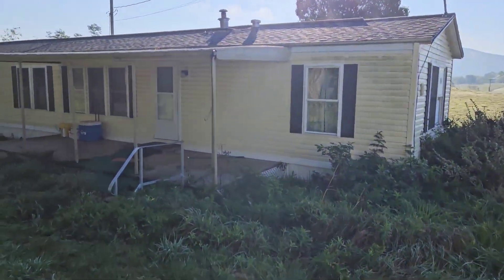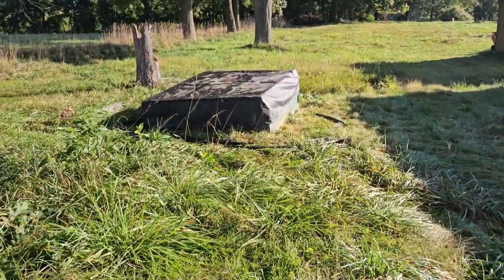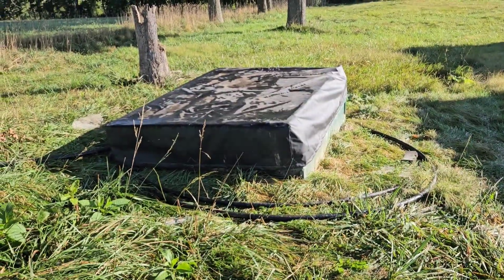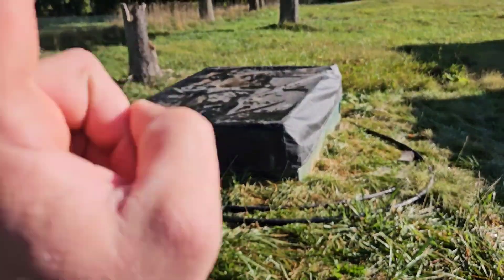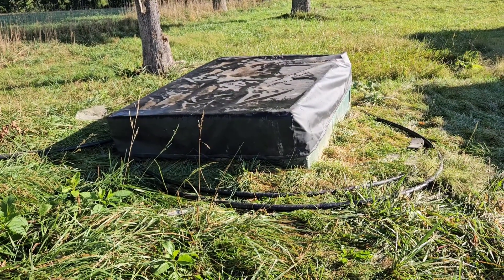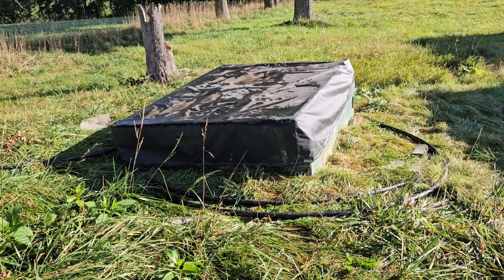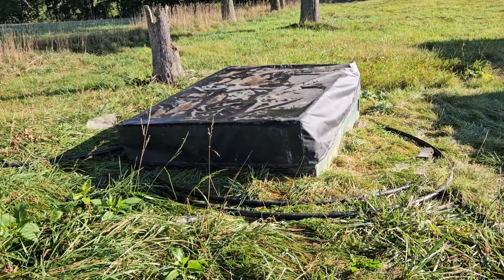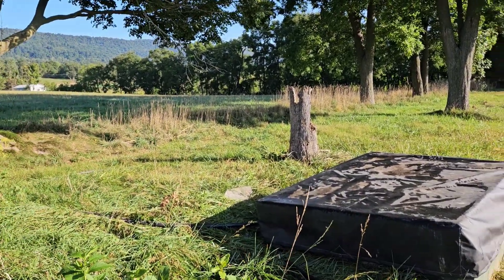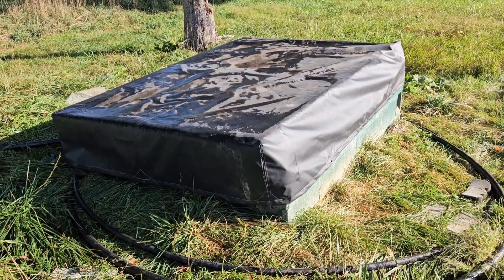Here's a mobile home that gets well water, and the well is in here. My uncle-in-law was asking about this. This is the cover that goes on top of those wells. You need to have covers on top of the wells in these cellars because without one, you'll rust out the pumps from water and snow, and you don't want animals hibernating in there — especially bears, which are out here.